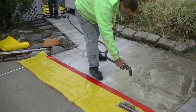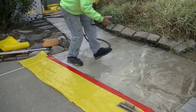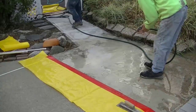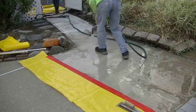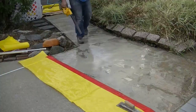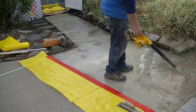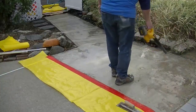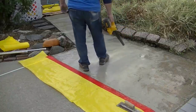Now I'm wetting the surface again to get the concrete damp, and I'm also rinsing off any of the dust Luke made with that rubbing stone. We want the surface damp again before we go over it with the resurfacing material — that's going to keep the resurfacing material from drying out too fast. It'll also make the resurfacing material lay out on the surface a little better. If you try to trowel a resurfacer on dry concrete, it's going to go on really tough and not spread out nicely. Luke's again removing any standing water and puddles — we just want the surface damp.